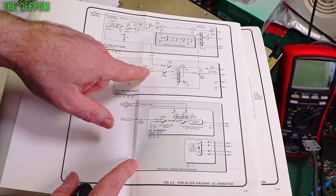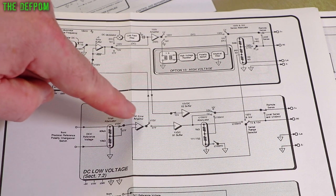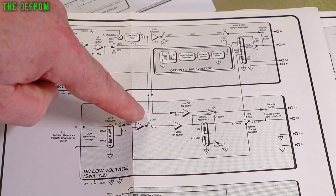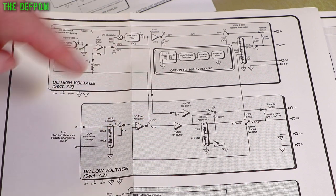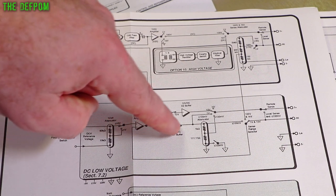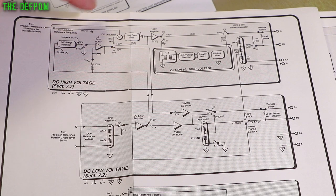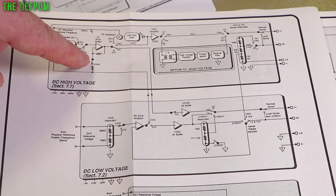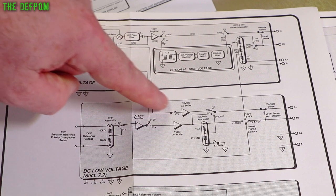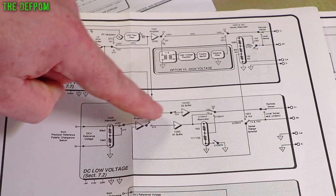Now it's got some paths it changes to depending on which voltage range you set. On the paths over here, you've got a switching between less than 1 volt, greater than 10 volts in this section. So if it's 1 volt range or less, it will come straight through basically. If it's 10 volt range, it switches, comes through up here, and then it will come back down again. Jumps over to the power amplifier board and it comes back. That's what it does, alright?